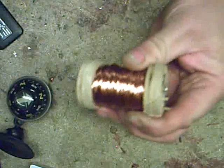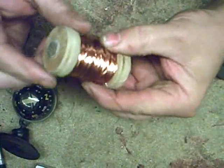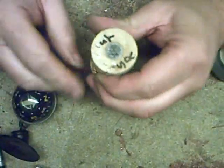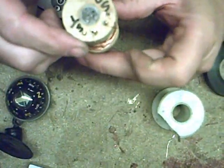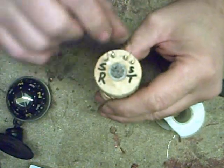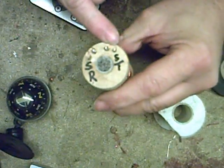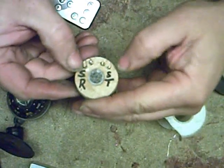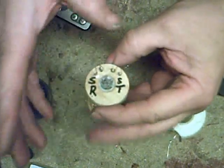I decided to run all my wire out because I want to recover it - when I've done this demonstration I'm going to strip it all down anyway. So this has actually got 800 turns on it, of both wires. As you can see, that's the coil finished. Now we're just going to put some tape round this area just to protect against any solder or anything like that. We've actually got the run part of the coil and the trigger side. So now you know - that's the start and that's the start of the two coils. Very important to know that because that's important to where it goes on the circuit.